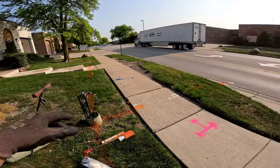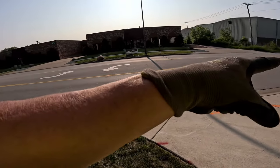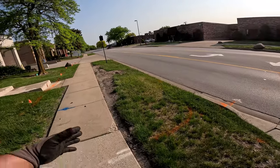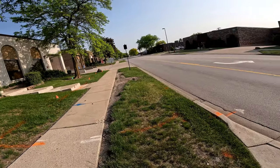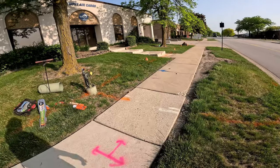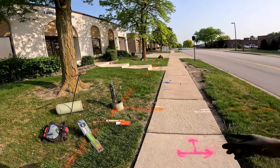Most of my current is going down this line crossing the road to that amplifier over there across the street. Since most of my current's going down this line — one going south and one shooting north — I'm not really getting a good tone on it. I am getting a markable tone, but I'm not catching the bend where it comes into this pad. It's crucial that you catch the bend, because most likely if you mark the bend wrong, the contractor's going to hit it — they always hit the bends, never the straight line. I want to make sure I got the radius right on this cable, going to that pad and bringing it back to catch the bend.